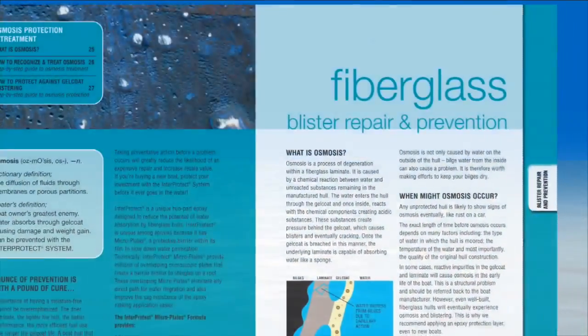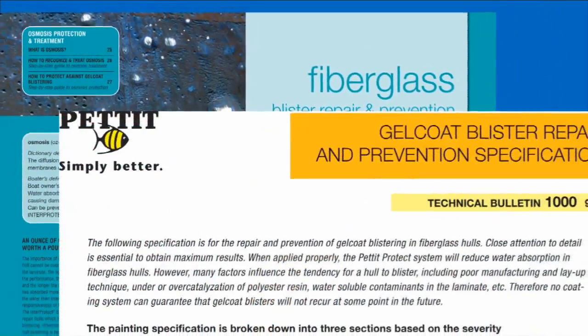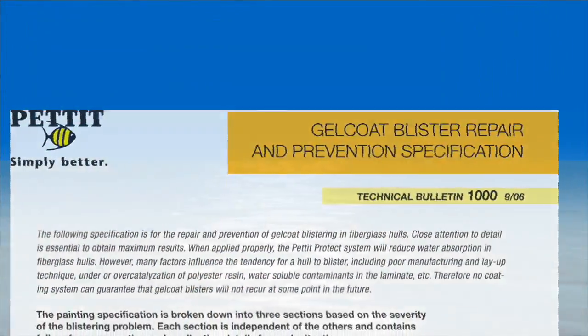If your boat develops blisters, there is a multi-step process involved to fix them. Interlux and Petit both have blister repair guides to help with the process. Of course, the best way to deal with blisters is to prevent them from occurring in the first place. Barrier coats are designed to do just that.